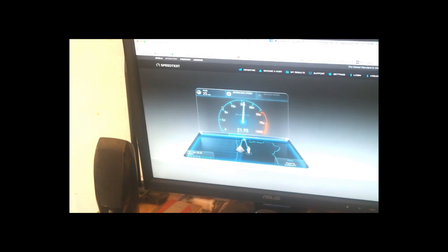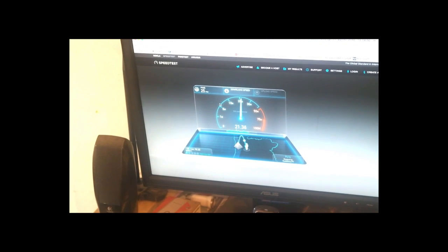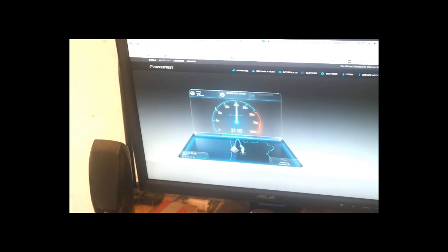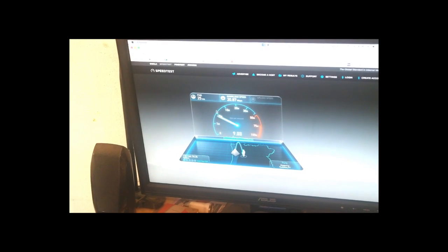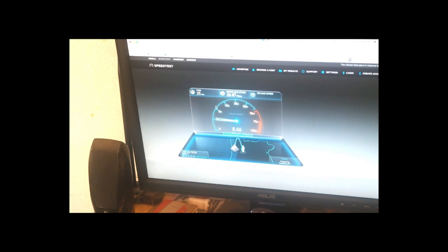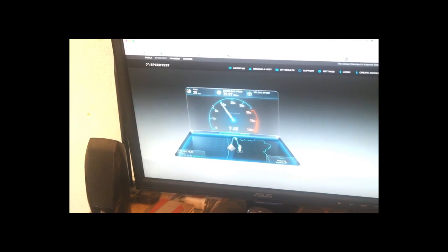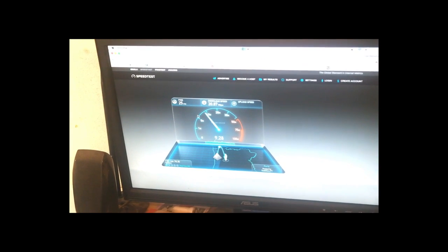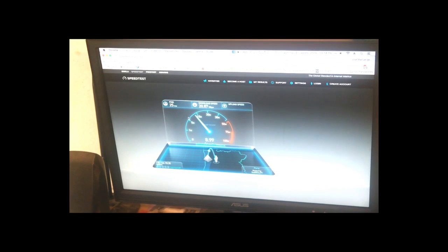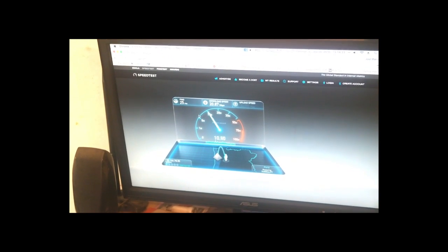It's a little bit slower today because it's the weekend — I'm getting 22 Mbps on one polarization. I found out that one polarization is a little bit weaker than the other; I get less bandwidth on one polarization than on the other. It's mainly because one of the antennas is not yet aligned correctly, which is why there's such a difference in speeds.